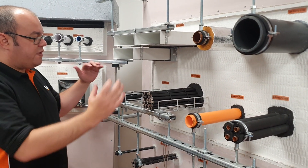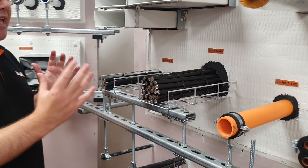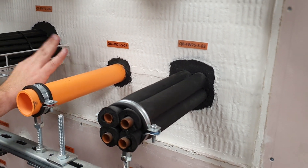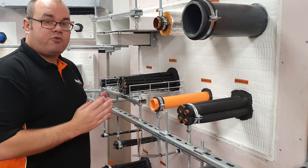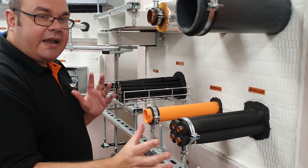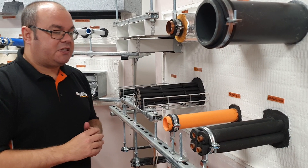Just below that, again in the letterbox, we've got applications for cable baskets — one using our acrylic sealant and one using our HPE sealant, depending on how many cables you've got. Just to the right we've got the CPVC sprinkler pipe application. We have tested this type of pipe in a number of different applications, and one of the great features with our HPE sealant is it's approved by both Lubrizol and Spears, the two main manufacturers of CPVC pipes. And finally, just to the right of that, you have your small air conditioning type insulated pipes — 15mm copper pipes with 9mm Armaflex going through in bundles — again using our HPE sealant.